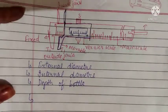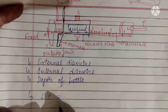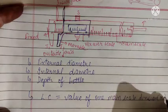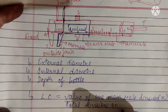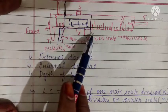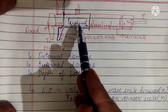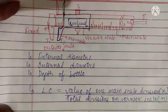The least count of the vernier caliper is: least count equals the value of one main scale division (x) divided by the total number of divisions on the vernier scale (n). For the total reading, we take the main scale reading directly, calculate the vernier scale reading as P multiplied by least count, where P is the vernier scale division coinciding with the main scale, and add them together to get the total reading.